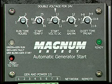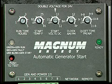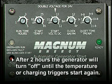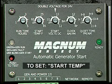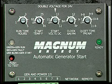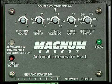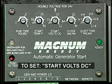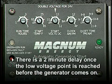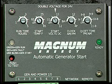Set the runtime hours on the first knob of the controller. The runtime can be set for one to five hours — this is the length of time the generator will run once activated. Two hours will usually take care of temperature and charging needs; after two hours, the generator will turn off until the temperature or charging triggers start it again. To set the start temp, slowly rotate the second knob counterclockwise for lower temperature and clockwise for higher temperature. The range is 65 to 85 degrees Fahrenheit, and this feature can be disabled by turning the knob counterclockwise to off. The start volts adjustment is made on the third knob; the factory setting is 11 volts DC and the range is 10 to 12 volts. Note there is a two-minute delay once the low voltage point is reached before the generator comes on. This feature can also be disabled by turning the knob to off.